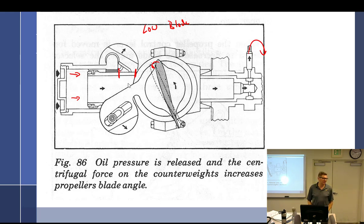But what was not fixable is he sent out the governor to be overhauled, and this particular governor has a very low pressure because of those rings. You can only go to like 100 and some PSI. They adjusted the governor pressure up to like 350, 500 PSI. And every one of those rings, I saw them, they were thin as a razor blade. They were so sharp you couldn't touch them. Ruined every single one of them. I'm like, oh, now you're done.